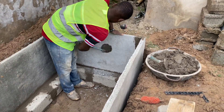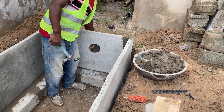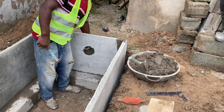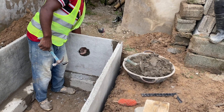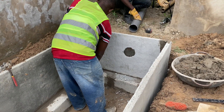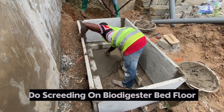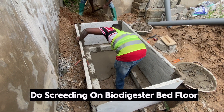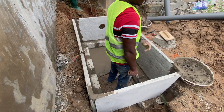Most of the pipes are coming from the other side, and the slope is towards the far end. The reason we are siting the digester at the lower end is because it is easy for the plumber to lay all his pipes to this side of the property. It makes it easier for gradient work, for sloping, and for letting the wastewater out through the leach pipe and soak away. We prefer a level gradient that will slowly seep the water out rather than a sharp slope.